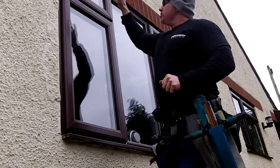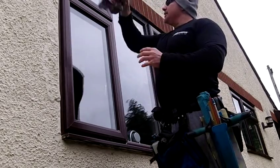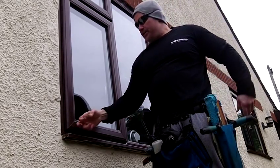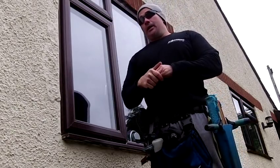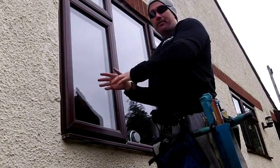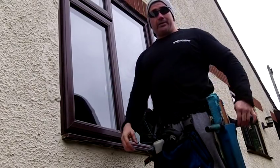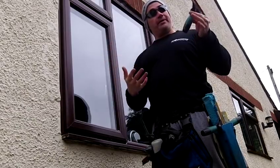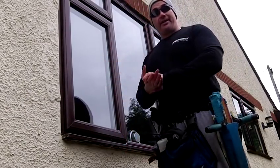I use a little bit of the moisture on the glass and then rub my sill cloth over and take as much dirt and dust off the frames, and then by squeegee. I don't want to touch this glass again. Once it's been squeegeed, that's it. I want to leave it and walk away, and that's what my talent, my soap solution method and my choice of tools allows me to do. I don't need to touch that glass ever again.